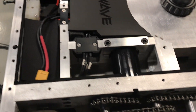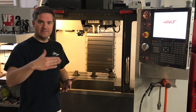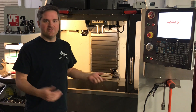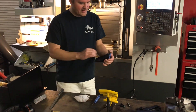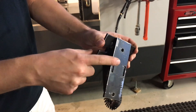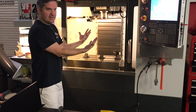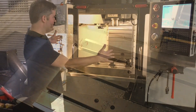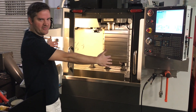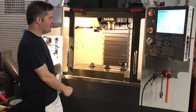This is the first year that we've actually had a fixture in the CNC mill to machine the wedge. Normally we use a tilting head manual mill, but we always had to borrow one from a friend. This year our friend got rid of their mill so we had to figure out how to do it. Basically we just take little laser-cut pieces of steel, weld them together at the right angle. Then we flip the wedge upside down so the pointy edge is face up, bolt it down, and run a program. Unfortunately our mill isn't long enough to do the entire wedge — the wedge is about 36 inches wide and we only have 30 inches of travel — so we have to do it in two steps: left half, then right half.